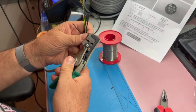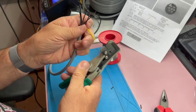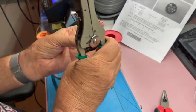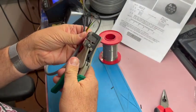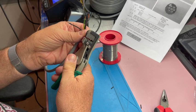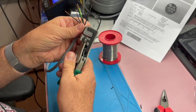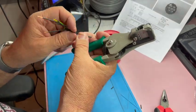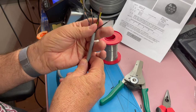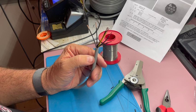Now this is a temporary setup, because this is not really the final rotator controller that it goes onto. But what we're trying to achieve today is just to actually run the rotator and test it, and make sure everything is working and this is correct. So no doubt everything will be, because Peter has already run it on his workbench. But yeah, we just need to replicate that. So we've got a working model. So I'm going to give these wires a bit of solder, so they're tinned up, and then we'll connect them.